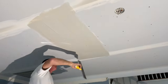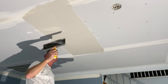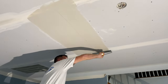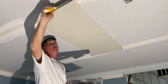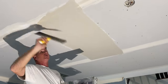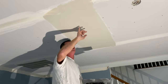If you get a little rollover, just re-feather. Essentially I'm leaving 12 inches of mud on this side, right across the center. I've got it full from here to here. You can wipe several times over hot mud because you're not leaving a lot of mud. Same thing on the other side — pressure is going to be on the outside. You don't want to go too far — you can stop like I did there. Clean your knife, get all that excess off, and run one more time. As you can see, I've left all the mud here on this side and all the mud here on this side, with just one little slight rollover in the center. Once this dries, just a light sand and paint it.